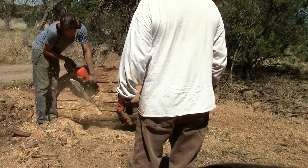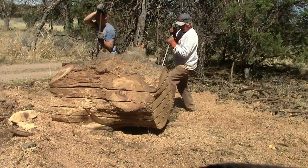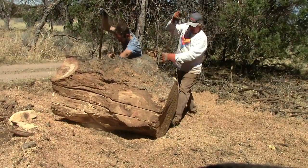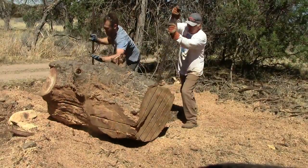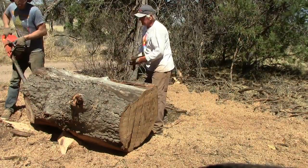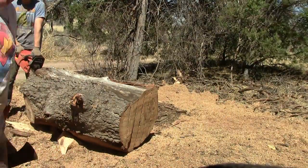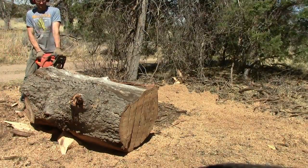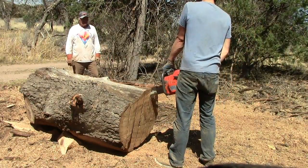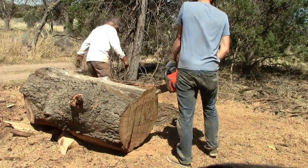Because if not, your cuts will be screwed up and you'll waste some log — it's just a whole mess. Danny let me use his Stihl to cut off a nub. I'm a Husky guy honestly — I grew up with it and it's just nostalgic for me, the sound. Flipping that log was hard; it was probably about 3,000 pounds. I'm now connecting the cuts on the other side by going up, being careful not to let the saw emerge out of the cut, because if it did it would kick back towards me. Kickback is where most accidents happen.